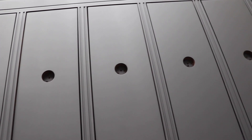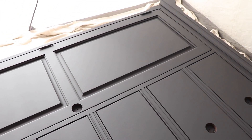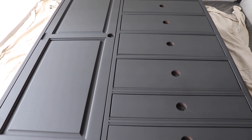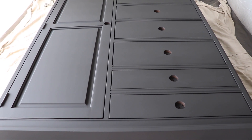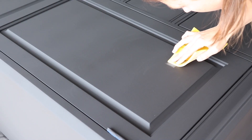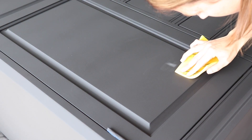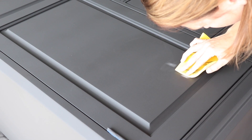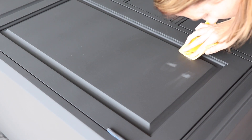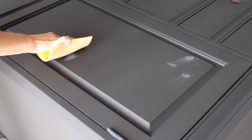I let this dry for two hours and it just leveled out beautifully — it looked so buttery smooth. It did have a few little hiccups here and there, but those are easy to buff out. I just grabbed a super fine surf prep rad pad and I'm sanding in those areas where I saw little pieces of fuzz or little imperfections fall in my finish. You could definitely sand down the entire coat to get a really super smooth finish, but I thought it looked great. So I'm just fixing those imperfections and then wiping back that dust with a black old t-shirt.